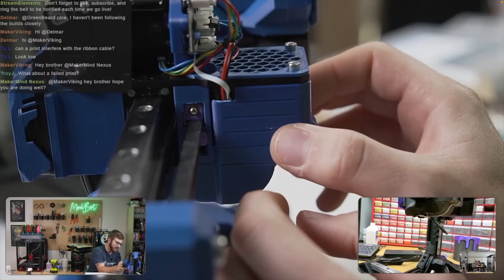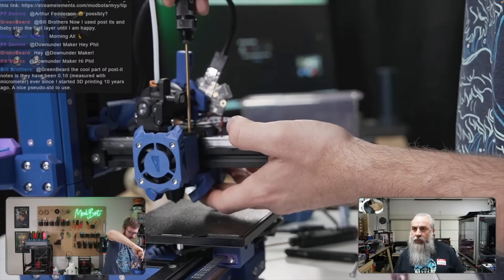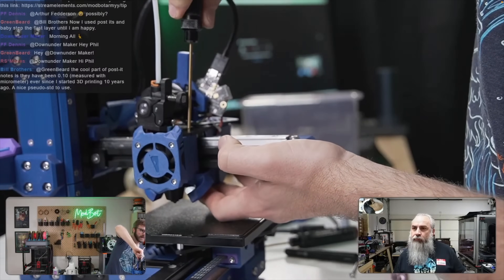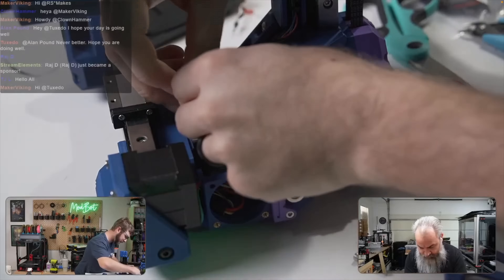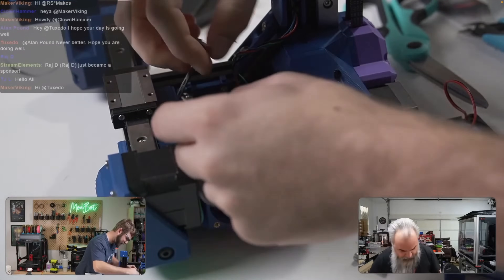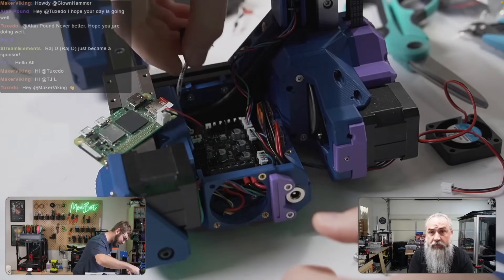I specifically had to play around with the wires on my toolhead board to get everything to fit, as well as make some last-minute adjustments to the eddy current mounting point so that it would trigger when the nozzle touched the bed. The crimping and routing of cables around the Pi in the tiny electronics bay was also a little bit difficult, even though Steve had designed a standoff that gave us as much clearance as possible.